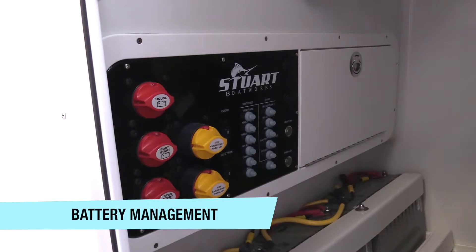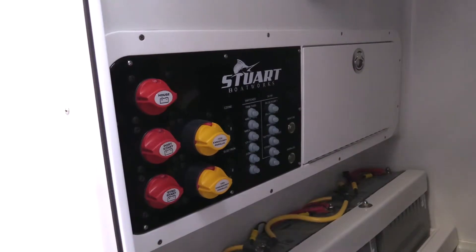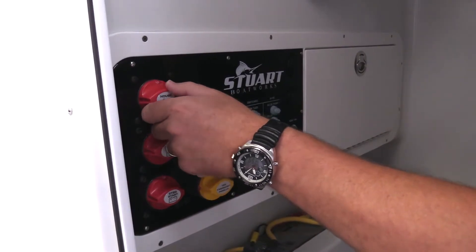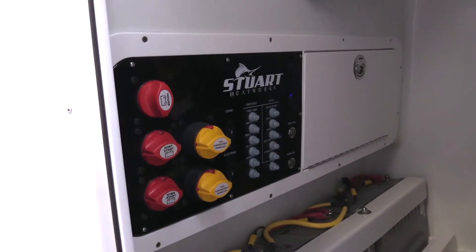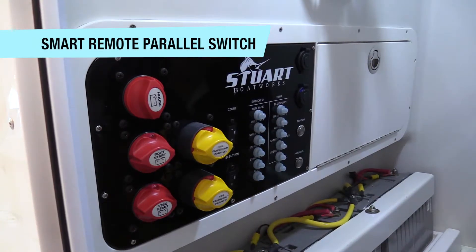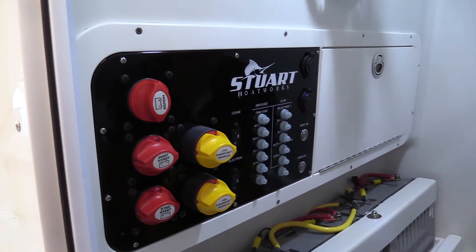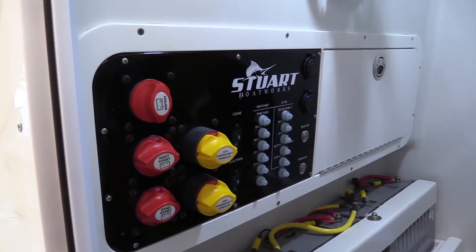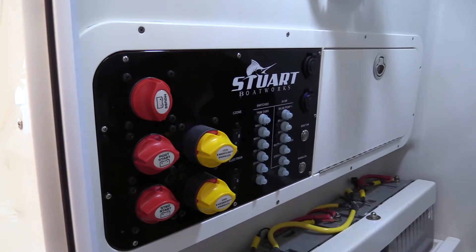Although the Stuart 27 is completely digital, the battery management side of things uses a standard on-off battery switch. We have three batteries and three battery switches — the top one is your house battery switch. When you turn that battery switch on, the system wakes up, C-Zone is on, and you have power to the boat. In addition, the Stuart BoatWorks 27 comes with the option of a smart remote parallel switch — a VSS voltage-sensitive switch — that works both as a parallel switch and as a VSR voltage-sensitive relay that allows your engine batteries to be charged.